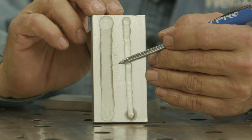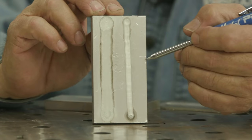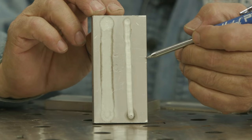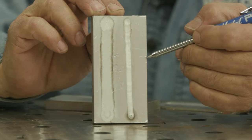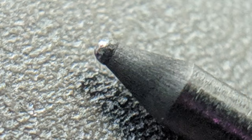It's wide, it's noticeable. It was running about 205 amps. Then I ran one at the total bottom side, the opposite — minus 55. Everything was narrow, and I also noticed I was actually melting this bead on three-eighths aluminum but only using a one-sixteenth tungsten. You'd think that with a one-sixteenth tungsten I'd just destroy it with amperage. Typically a one-sixteenth tungsten's carrying capacity is about 80 to 120 amps, and you're telling me you've got 205 amps and you didn't tear up your tungsten?